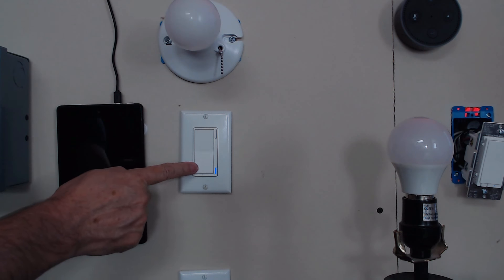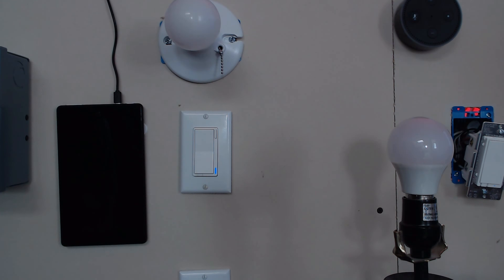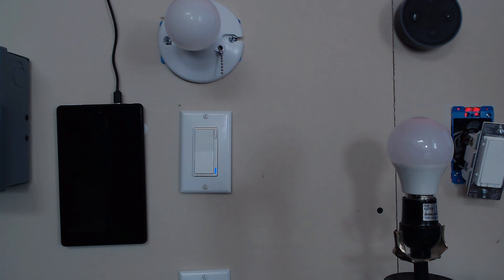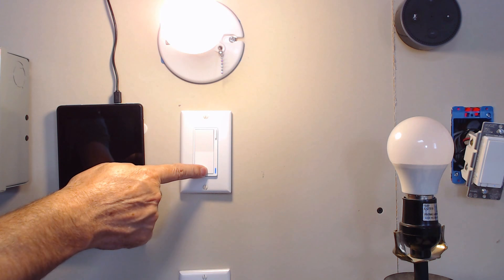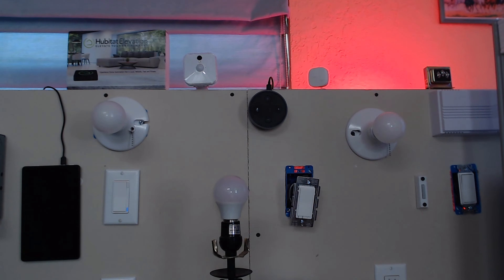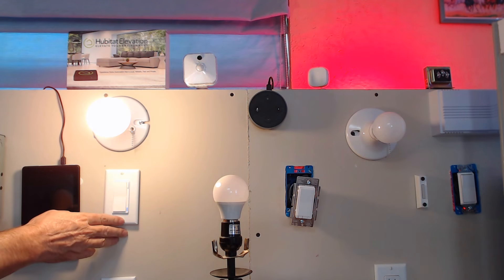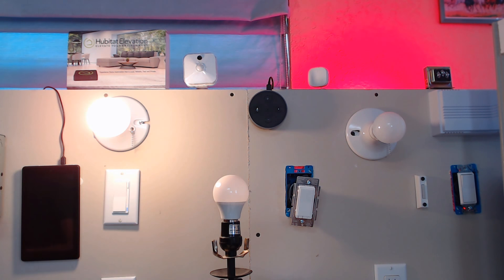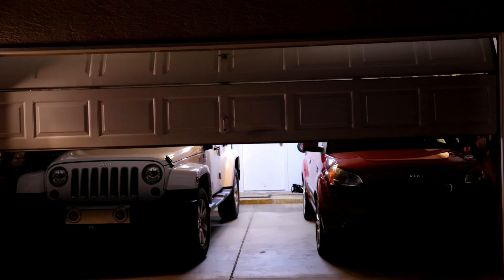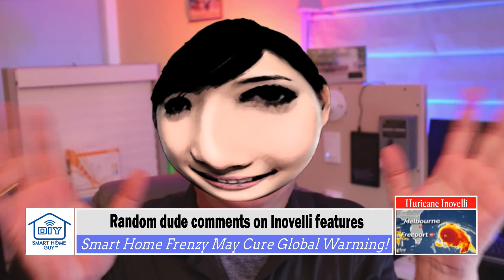For scene control, I mentioned that you have 13 native scene commands capable directly from the switch, accomplished by single or multi-tapping on either side of the button. For example, you can have up to five clicks on the up and five clicks on the down, plus hold up and hold down, for a total of 12 combinations. Note this is different from SmartThings where you had up to six double taps. Altogether, 12 scenes you can control from the paddle. A single tap up turns on the light associated with the Inovelli switch; double tapping up turns on the light associated with the Zooz Zen27. You can also tap the configure button for one additional scene, and that makes 13 scenes — this is madness!